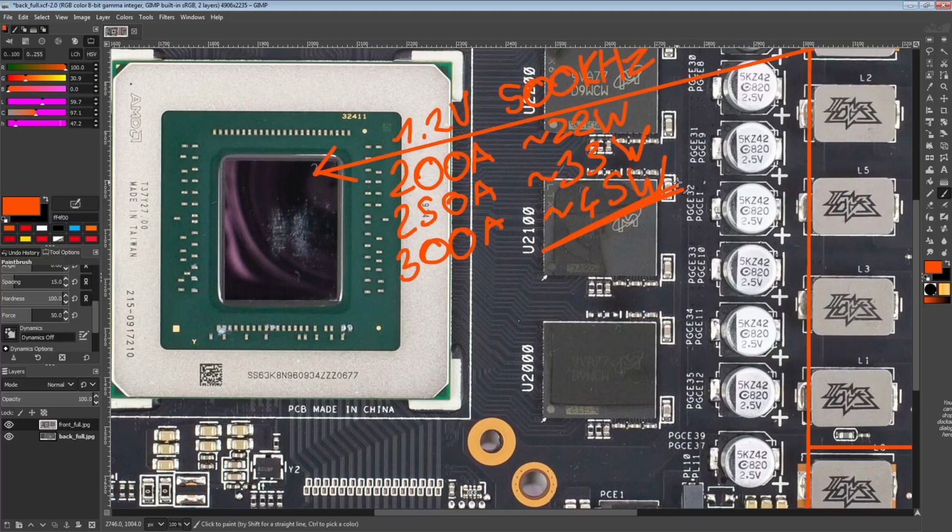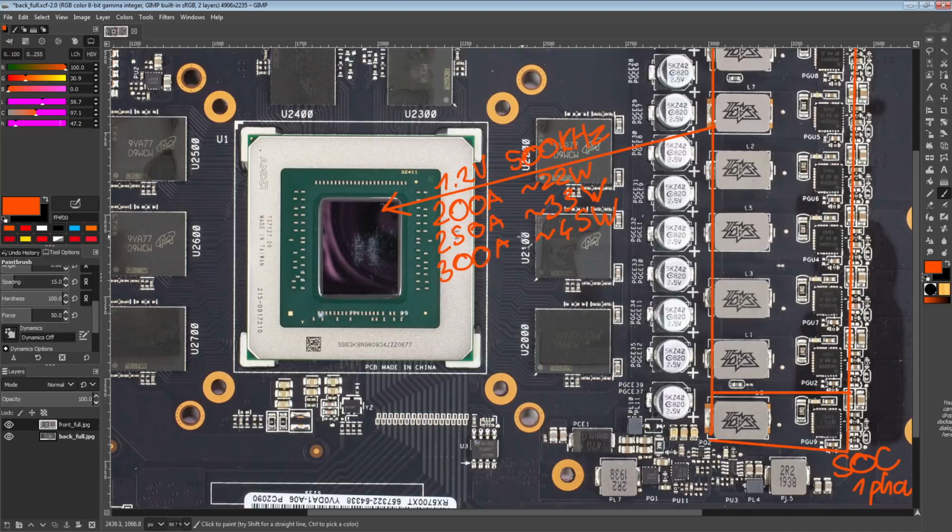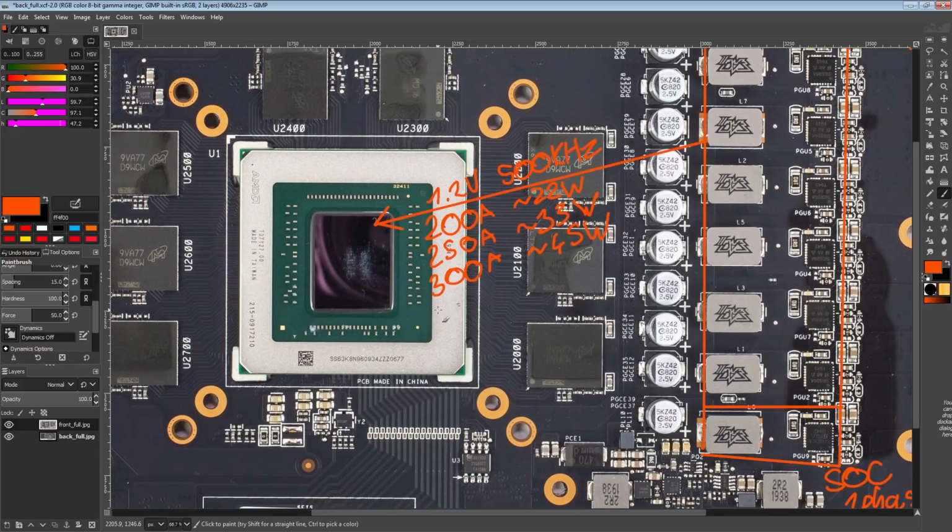At the same time, I'm pretty sure you can't get a 5700 XT to pull 300 amps average current on any kind of ambient cooling. So it's not really a concern. This is not something you'd be able to do with the card. So the VRM getting pretty damn hot when you do that doesn't really matter, because you'd be on liquid nitrogen or something. And if you're on liquid nitrogen, the benchmarks don't last that long, and not overheating for 2 minutes is a lot easier than not overheating for 2 hours. So that's kind of the thing there.